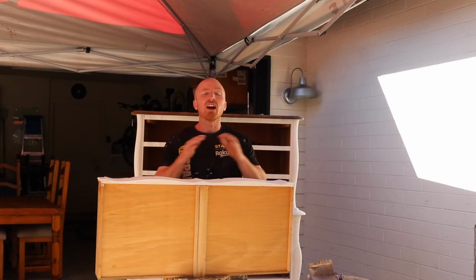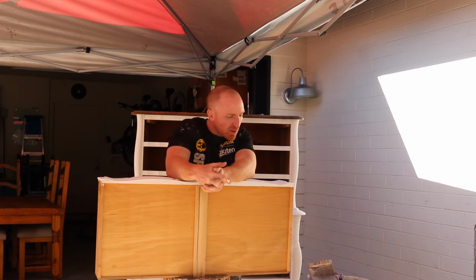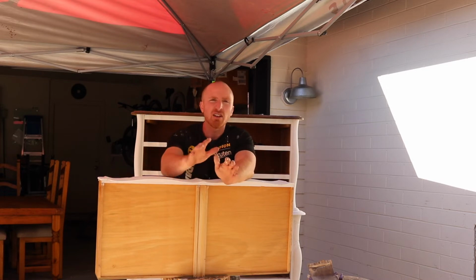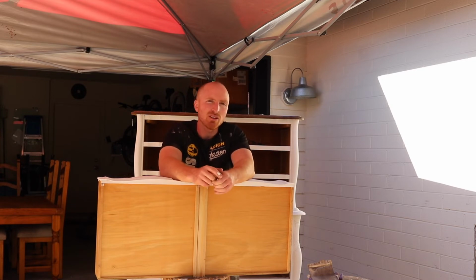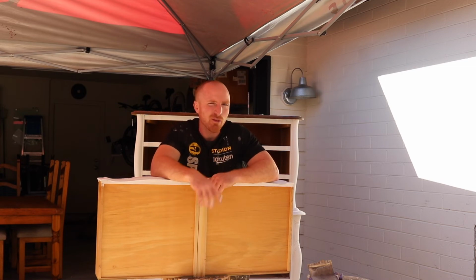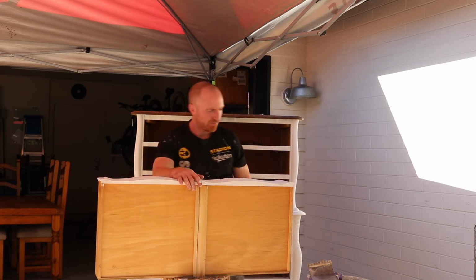Coats of paint on. Now what we're going to do is scuff it up. For most of you at home, if you want it solid, definitely skip this step. But we're going to grab some of this old 80 grit sandpaper. We're going to do the edge work just around the edges and give it a nice little vintage feel. Shouldn't take very long. Then we'll wipe it out, clean it up, and then we can start waxing, which if you're not going to be scuffing up, you can skip right to the wax. Well, how about not skip? Just watch me sand for a little bit. Be like 40 seconds of pure fun. My torture time. But we'll get right to the waxing step and get this piece finalized.